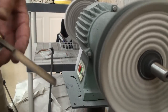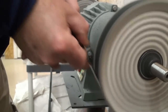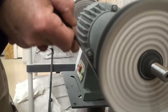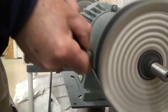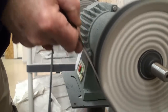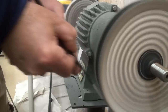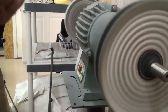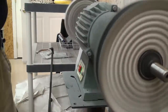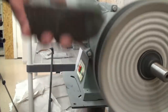When you're coming back, that's what they call a cutting stroke. When I'm pulling back into the wheel, the guys who do this for a living will tell you that's a cutting stroke. When you come this way, just with the wheel, that's what they call a polish stroke — it slows down. See how black that got? That's why I don't put much on.